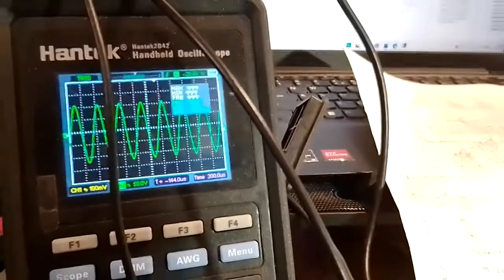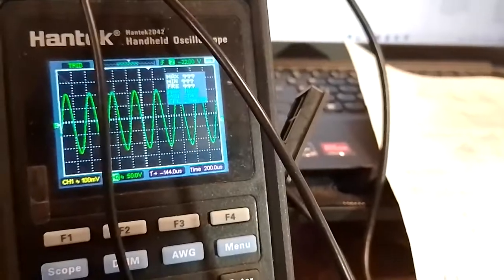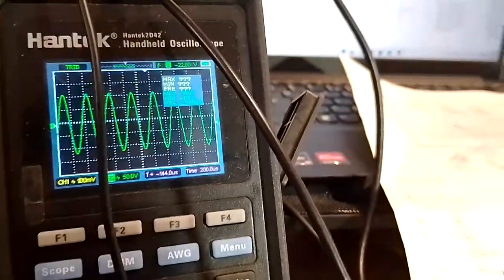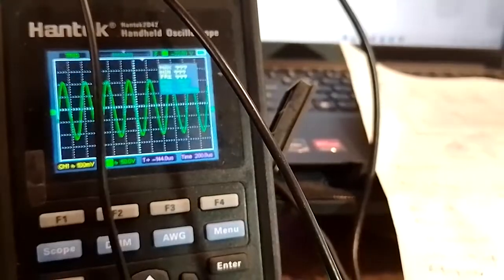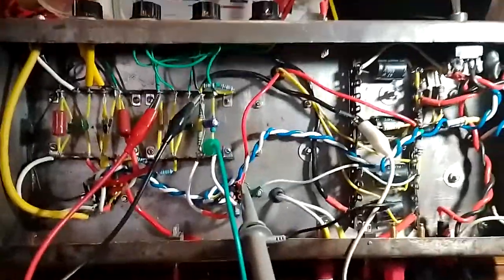So yep, there is quite a bit of voltage gain in the stage, even though that is not the primary purpose here, considering that we are putting in just 2.5 volts. That might be a little bit more than expected. Actually, I'm not sure if I have hooked up the correct secondary windings of the transformer. I'll dig a little bit more into it, but for now I'm happy that it works. And interestingly, I don't know if you can hear it, but probably not, but I can actually hear a little bit of a tone from the vibration of the output transformer.